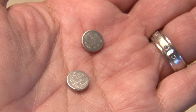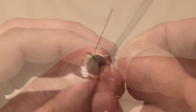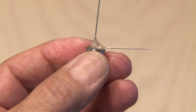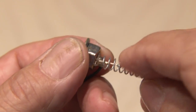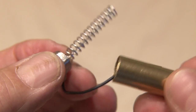I picked up two small button cell batteries that will fit right inside our bullet beacon. Now let's get to the LED. We're going to bend the positive leg straight down, then we're going to add some hot glue to prevent any shorts, and we'll slip the small spring on the negative leg. Then we'll make a solder connection there and solder the one wire from our switch to the positive leg of the LED.